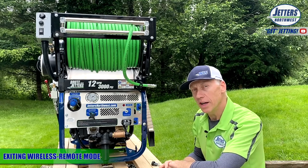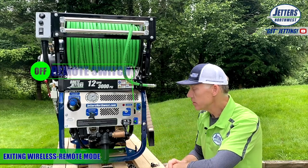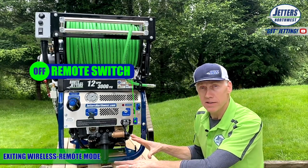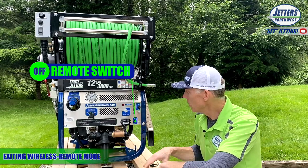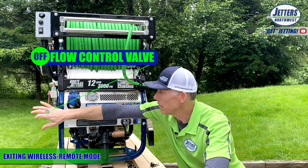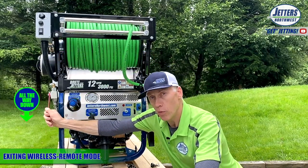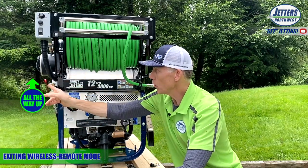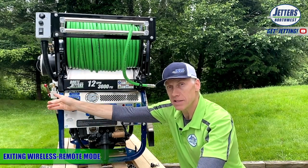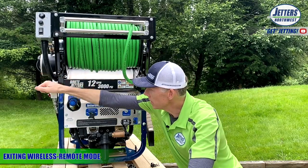Now that we've shown you the remote control — when you're done jetting or going back to manual control with the key, you want to turn the remote system off. That also keeps there's no draw on the battery. Say you've got it set aside overnight or haven't jetted for a week — make sure this is off. For safety's sake, take your main jetting control valve — the flow control valve — back down to the safety position. It's very important with this valve to make sure it's all the way down when storing, or all the way up when jetting. People wear these out prematurely by leaving it at about 90%, which causes water to weep past the valve seats at high velocity. So when you're jetting, this goes all the way up; when you're not jetting, it goes all the way down.